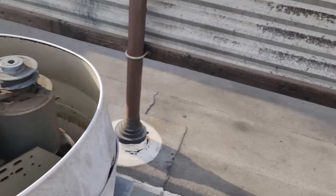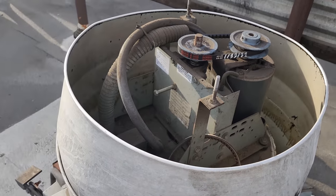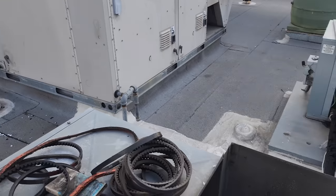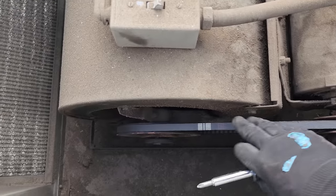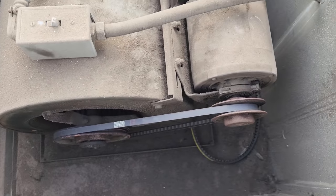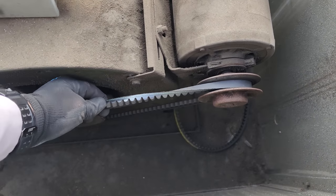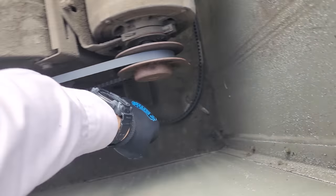Since these are a year old, we're probably just going to do new belts on everything. I'm getting a list — looking at the makeup air unit, and we're going to look at the ACs too. We're going to look at all the belts on the roof. This one is extremely loose and cracked. We'll just get new ones — it's an AX41.